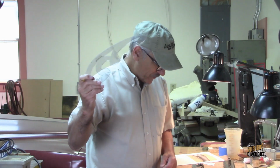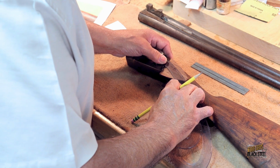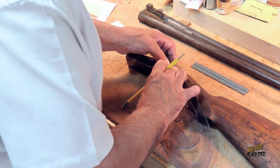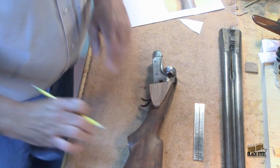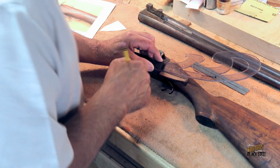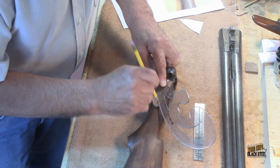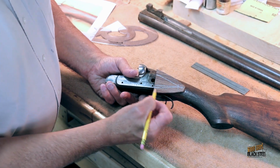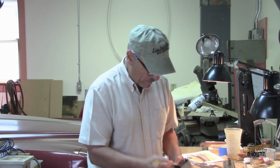So using the French curve, and then using those parts that I found to match, and to be probably the most pleasing, I can then come back and draw that line, flip it over to the section that is the bottom, and it follows that light line and it comes up to the pointy part, and I draw that, and I have a panel that should closely replicate what was there.